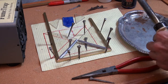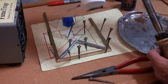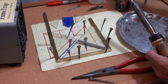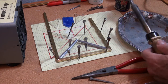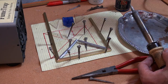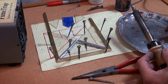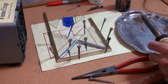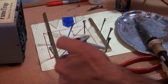Now we're back with the hot soldering iron. You need some flux — this is the stained glass flux, good for all kinds of soldering. I've got a thicker kind with a little brush on it. Start by putting a little flux on the tip of the soldering iron to clean it off. I'm going to use 50/50 because it runs a little better, and I'm going to tin the tip — just put some fresh solder on it. I've got a non-flammable pan here to put the soldering iron down on.